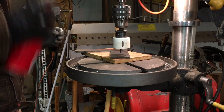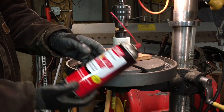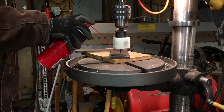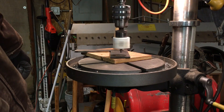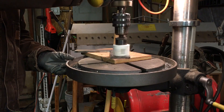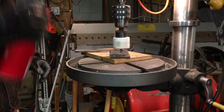To start off, I'm going to lubricate my hole saw. I'll turn this on and just use a little bit of spray lubrication. I use Power Lube from Napa, the CRC product — excellent, great for lubricating. I also use it as a cutting oil and it works really well. Get a little bit on the teeth there. And I've got the drill press on the lowest, slowest speed setting. That's very important because this is such a large diameter hole saw.